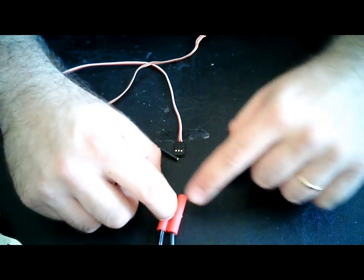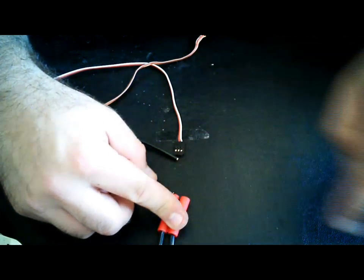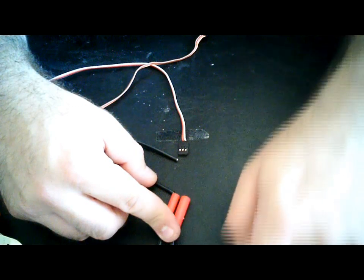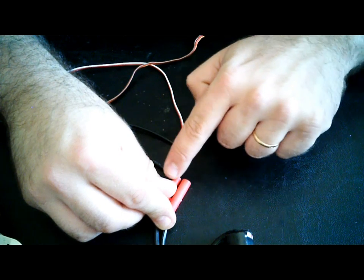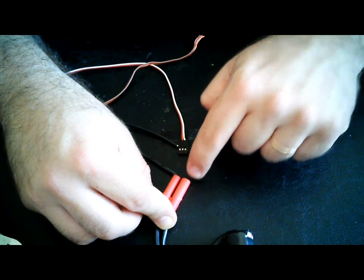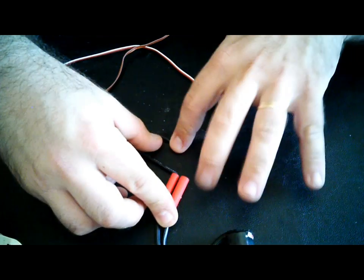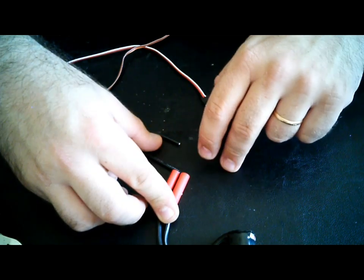Black wire over here, red wire to the motor, okay? Connector from here to here, and a connector from the positive to the motor, to the plug. And then this goes directly to the ground of the motor, okay? You just close the circuit over here. So this goes into here to the black of the battery, negative. Positive goes directly from here to the plug, and from the ground of the motor comes a wire that plugs into here. There's your circuit, closes and opens. Okay? Simple, easy to do. If you have any questions, just post them.